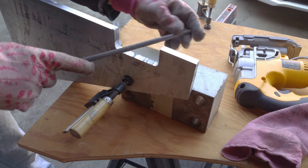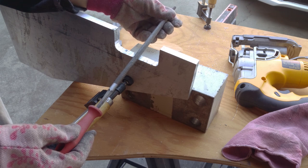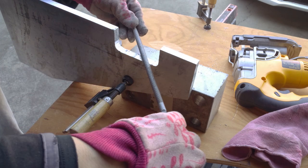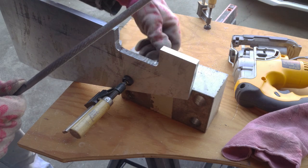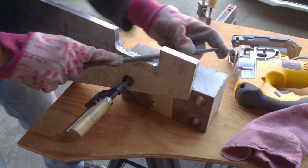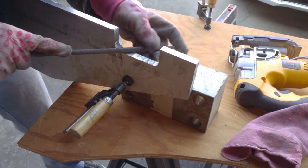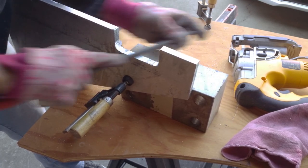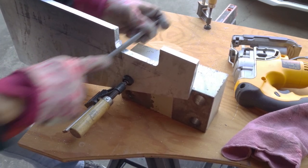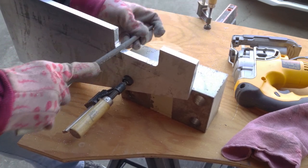I'm mostly pushing on it - so it's like heave, drag, heave, drag. That's kind of the motion you want. The more I change my angle to straighten out, the greater the chance of it not being straight, but I've got to blend this little radius a little bit. This is a very non-critical measurement thing - this is mostly for aesthetics as long as there's no real big stress concentrators or a notch in this, because depending on what you're making it could be a problem.